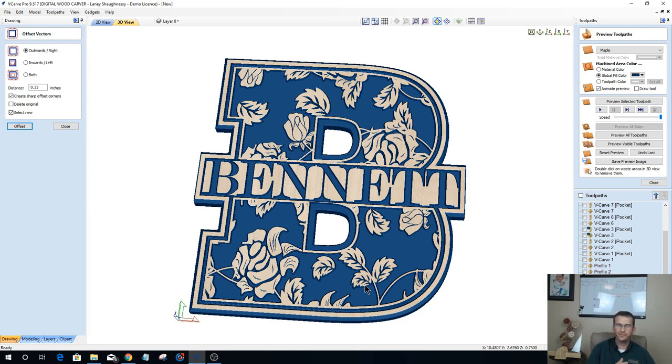And I'm hoping that, with just some of the samples that you saw tonight, it was enough of a repeat. All we did was create the pattern, create the vectors, and then trim. Are we clearing outside of that border, or are we clearing inside of that border? Where do we want our pattern to fall? And then from there, we're working with offsets to make that gap. I like the offset because it gives us this nice wooden border around our edge, so our design isn't bleeding right into it. And our cut is spaced away from our design, so I'm not getting V cut into those flowers and leaves.